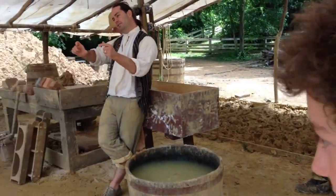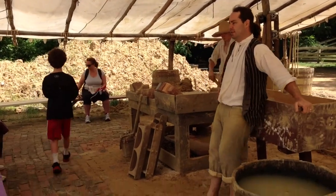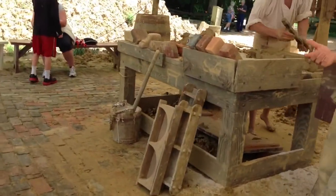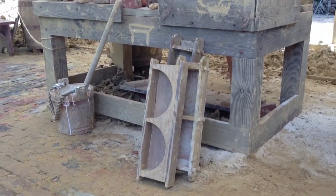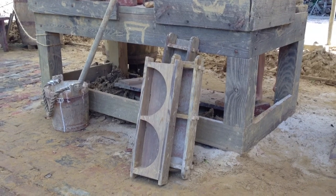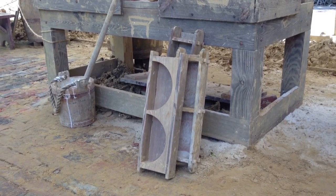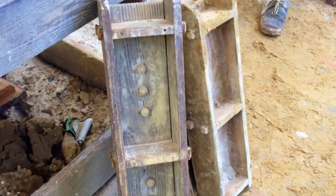Everything's salvageable to a point. In brick construction there's always halves, quarters, thirds — pieces to make up the funky gaps and spaces that you get. So a lot of it could just get used up in construction. With the better-fired, harder-fired bricks you can use them for paving. You'll see what's called brick bat paving — brick bat just meaning broken bricks — for like a workspace or maybe a floor.